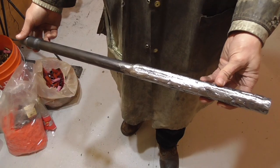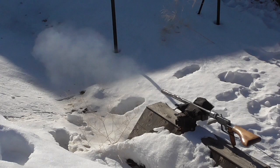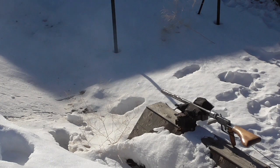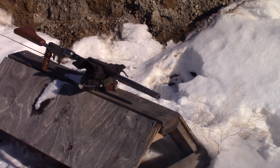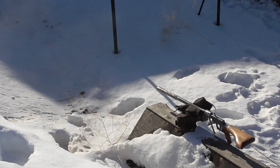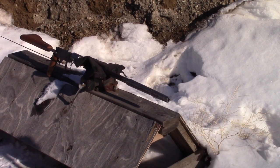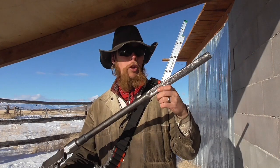Once those strips of material had been removed, I replaced them with steel rods, which I welded in place at a slight angle so they would taper inward toward the muzzle — and this was the result. Upon completing the barrel, I proof tested it remotely. As crude as this barrel may look on the outside, it passed the proof test with flying colors. So now the question remains: will it actually produce a cruciform pattern?